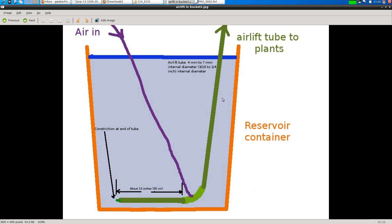In an earlier video today I was showing quite extraordinary lift, and the little plugs of water were maintaining their size fairly well. If you see a plug of water going up fast it gets smaller, and as it slows down it gets bigger. The ideal is to have the plugs going up at a very even rate, meaning the pressure is even and that wiggling motion isn't occurring.